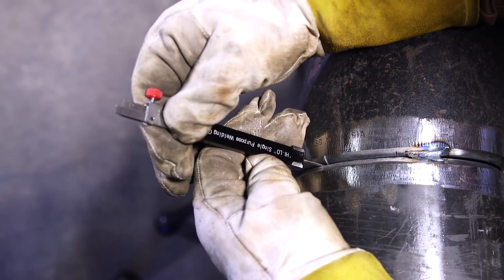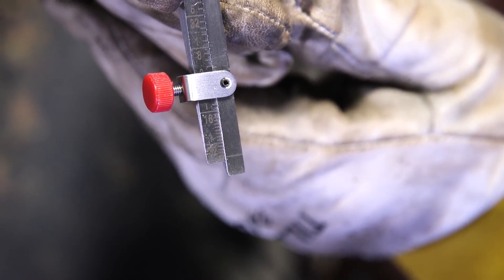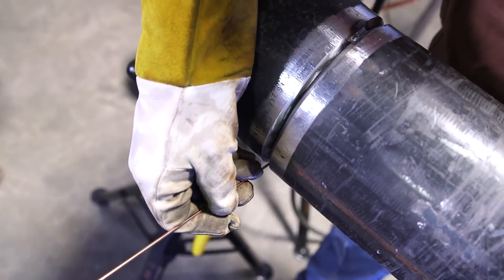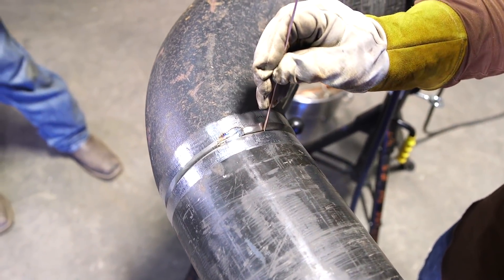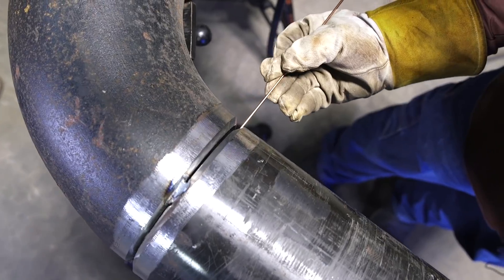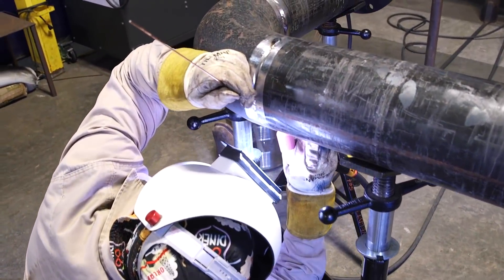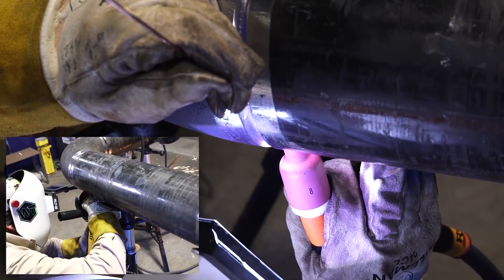Let me get this high-low gauge in on this end — there's a large amount of high-low. This line should be lined up with the 32nd line right there. I've got a 3/32 wire here to show you how tight this actually is. It finally starts going in right there, still pretty loose, getting looser toward the bottom. This side barely goes in. This fit-up is actually really, really bad. We're all tacked up, and I'm going to get ready to start welding this bad fit.